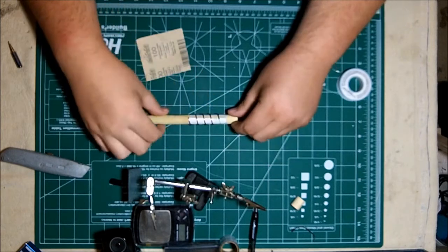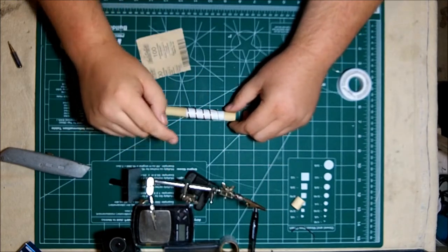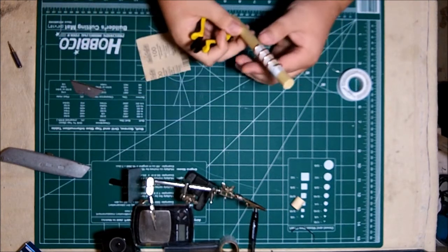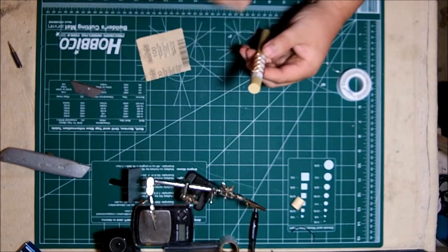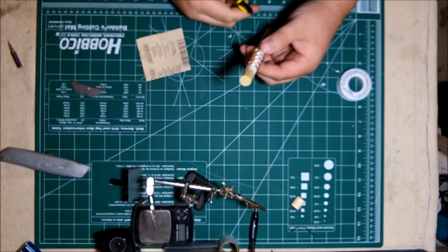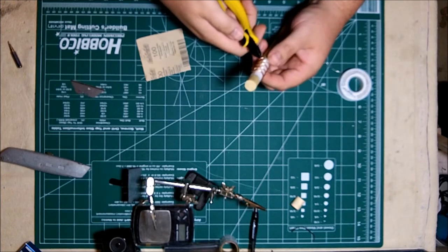that we drilled up 3 turns each one. And then I'll cut it where it enters the hole, and then I'll cut it 3 coils up to get my 3-turn helicoil. And this is of course right-handed. Left-handed would spin the other way.